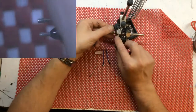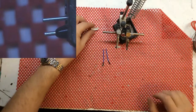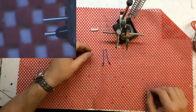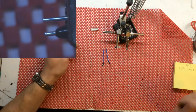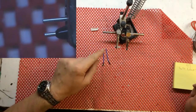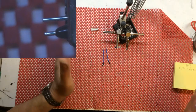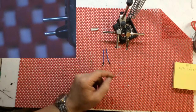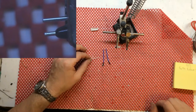for doing this. And I hear a lot of you say the solder will just melt at these temperatures, but this is a high melting point solder. It's got a melting point of 227, so if the solder junctions do melt, the fuse should have gone anyway. So either way, this fuse will cut the power and save the device.